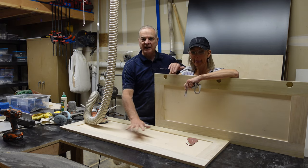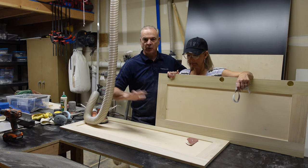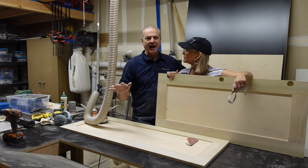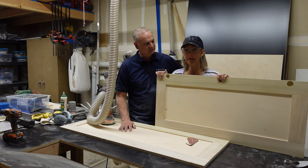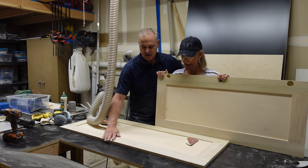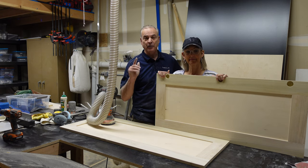Today we did a new cabinet in our kitchen, but it's exactly the same way that you do it in a van. We're going to take you through step-by-step exactly how we get a glass-like finish on our cabinets. P number one is prep. You're going to want to sand your raw wood with 220 sandpaper and then clean it up. The 220 will give you a nice finish on the wood. You want to sand all the edges and all the flat surfaces.